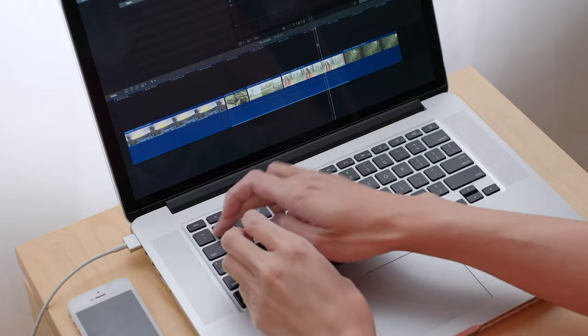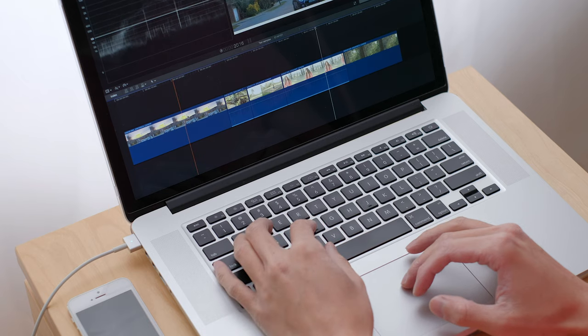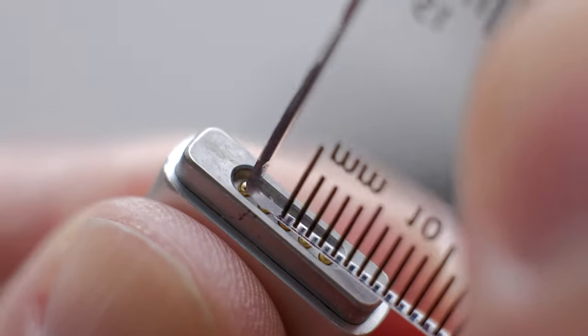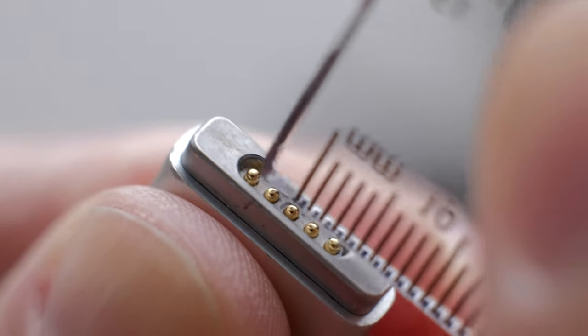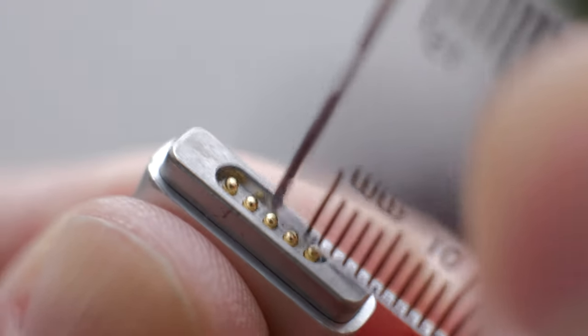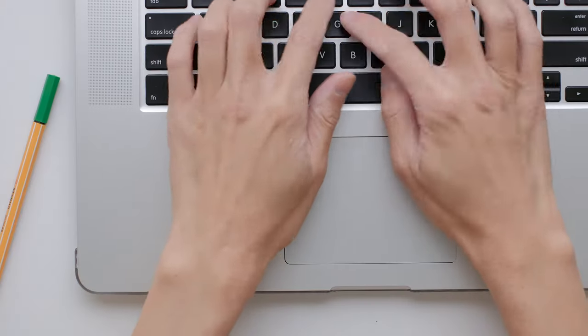Like I mentioned at the beginning, I don't know how many people are still on older MacBook Airs or Pros with these MagSafe connectors, but I'd suggest you take a quick look — check if they're clean, if any pins are stuck, or if there are any burn marks on them, just to be safe. I really don't want anyone to have a fire hazard by not knowing this, like me, despite using their MacBook for over half a decade.